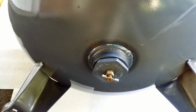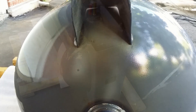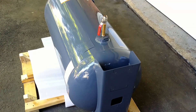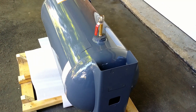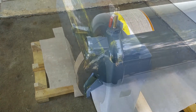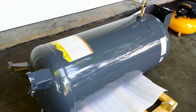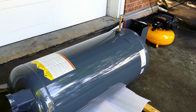This is potentially the weakest part of the tank, where water condensate accumulates and it should be drained regularly. Hold on — this is the air compressor, so where is the water coming from? The water is in the air, in the form of vapor. It is sucked into the compressor and with the temperature and pressure, it is squeezed out of the air and collected at the bottom of the tank. The water corrodes the metal wall, the structure weakens over time — and what do we have? Kaboom is the right answer.